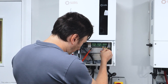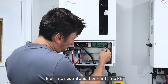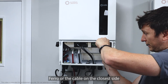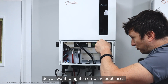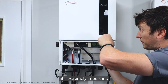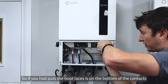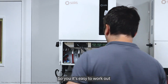I'm going to stick live into L, blue into neutral and then earth into PE. It's very important that you put the ferrule or the cable on the closest side to you of the contact. You want to tighten onto the boot lace and make sure it's making good contact. If you had put the boot laces on the bottom of the contact and tightened it shut, they would just fall out immediately — so it's easy to work out when you've made a mistake.